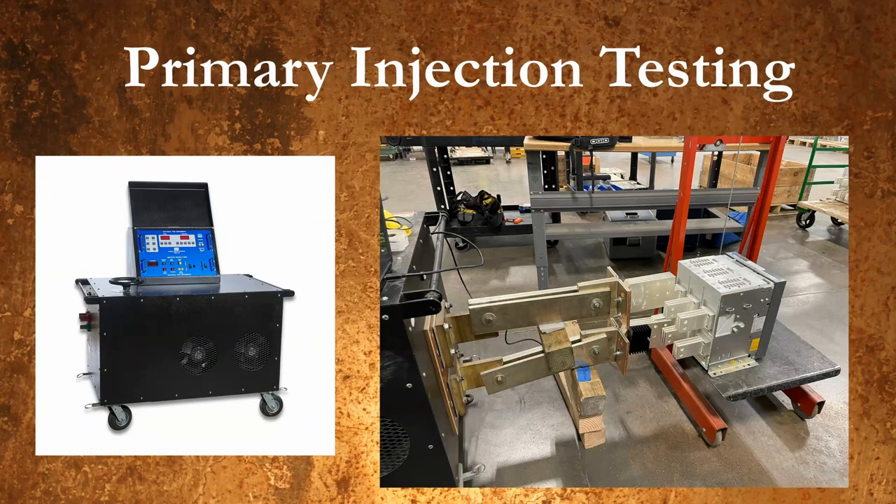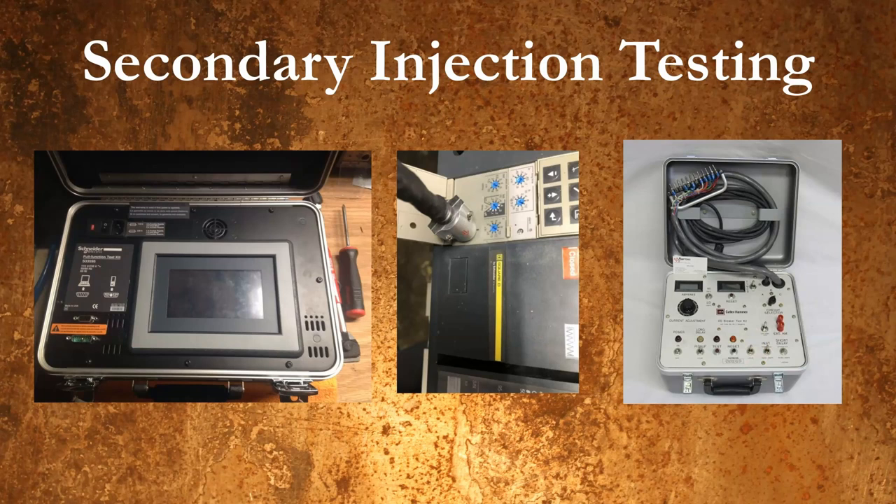Primary injection is part of the acceptance testing procedure for low voltage power circuit breakers. We verify that the trip unit is configured correctly and that the breaker trips at the correct amount of current within an acceptable time delay. This requires a test set capable of delivering huge amounts of current — sometimes up to a hundred thousand amps — to simulate faults the breaker may see once in service. We can verify that nearly every component of the breaker works accurately prior to putting it in service. However, it isn't always practical to perform primary injection after equipment has gone into service. For maintenance testing, we often perform secondary injection instead, using a specialized test kit or software specific to the trip unit type. We bypass the breaker's CTs using a lower magnitude of current pumped straight into the trip unit to simulate faults — this is acceptable for maintenance testing but doesn't fully test all internal wiring or the CTs.